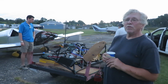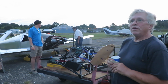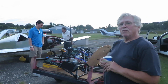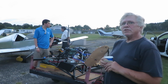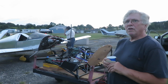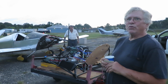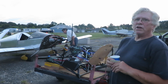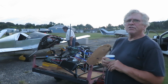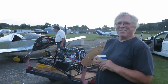I'm replacing a two-liter aero VW engine — a flat-four air-cooled engine — with another air-cooled four, but one with dual overhead cams and fuel injection. The idea is better fuel efficiency, more power, and I expect more reliability and less tuning. I'm also making a prop change that I think will make for a pretty noticeable advantage, unless I cut holes in the runway with the tips.